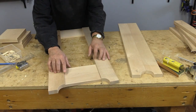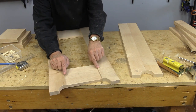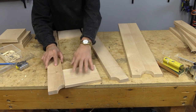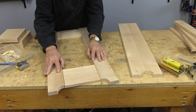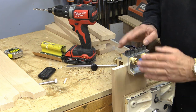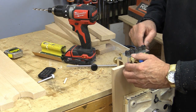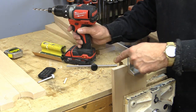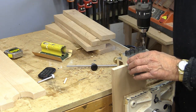There's what the legs look like. I put it at a little bit of an angle so you'll be able to see the shadow on this side — you can see that this piece of wood is half-inch and this is three-quarter inch, so we get a little bit of a reveal in here. I've got the middle piece all set up ready to drill and I've installed the little piece in the doweling jig, so I'm going to drill position one, then I'm going to move it so that we drill this hole down here, and you'll see what that looks like.